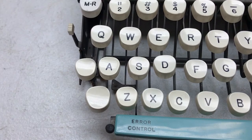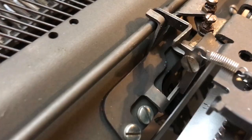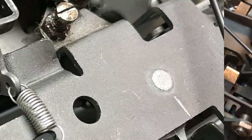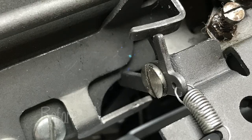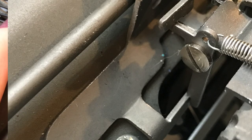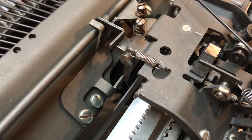With that piece working, putting the typewriter back into the case exposed more problems. First, the shift wasn't working at all. Using reference photos from Ted, we determined that an arm resting on the frame was supposed to hit a specific bar to move the shift mechanism up and down — we had just put it in wrong. The wear marks on the machine itself confirmed the correct position. Now I know how important wear marks are in determining how a typewriter actually operates. Will that help me later? Probably not.